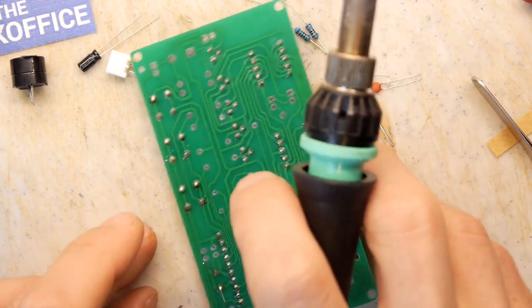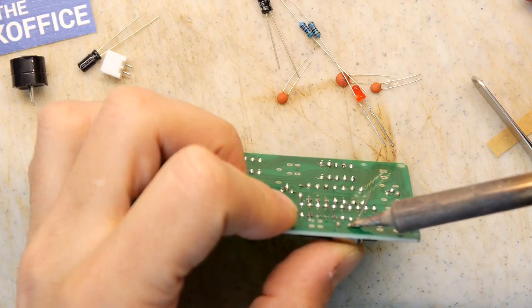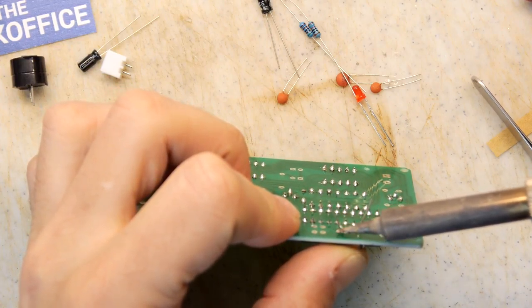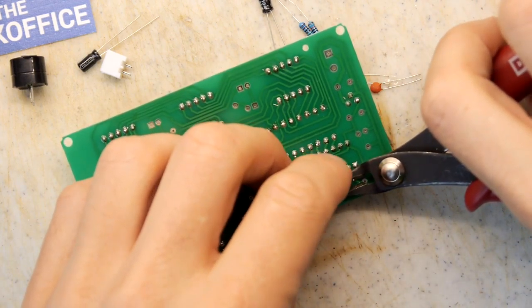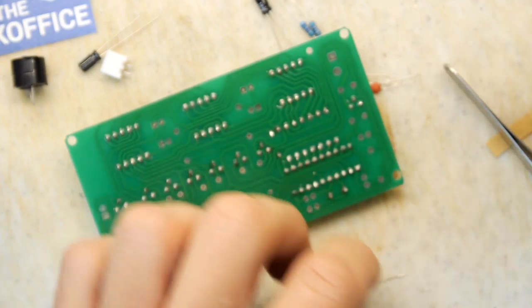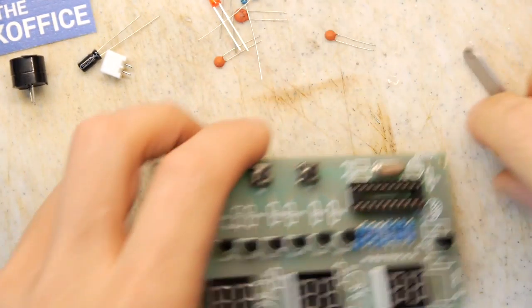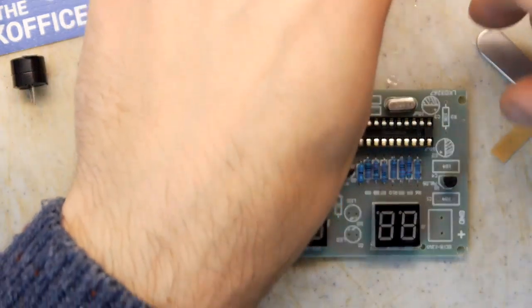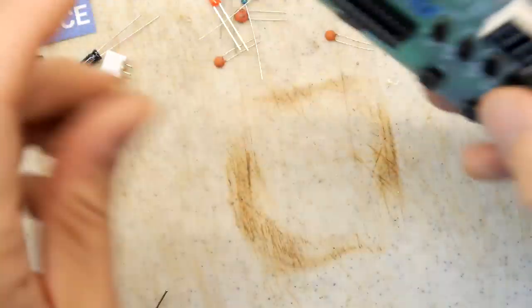Something interesting with crystals, if you're ever dealing with them, have a look on the data sheet for the microcontroller or component that you're using, because they do come in a few different flavors, and it's to do, it seems, with how the crystal is cut, if I recall. There's some sort of way the crystal's prepared means it vibrates in a slightly different way, and if you use the wrong crystal, you're basically stuffed.